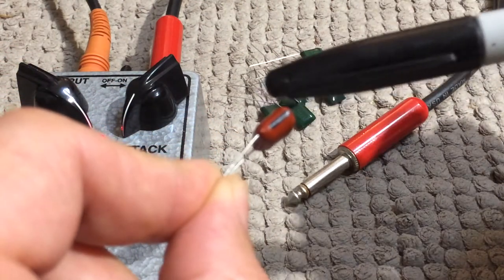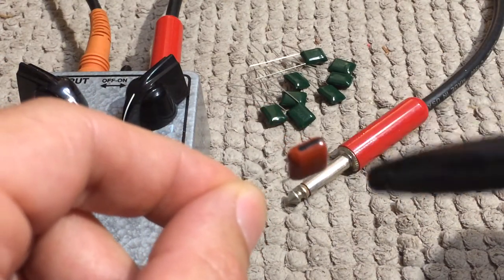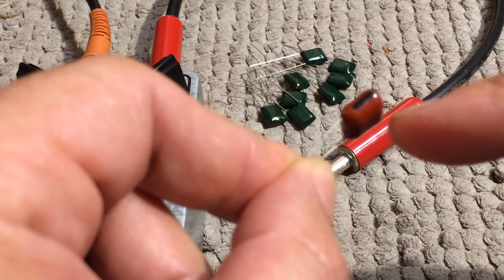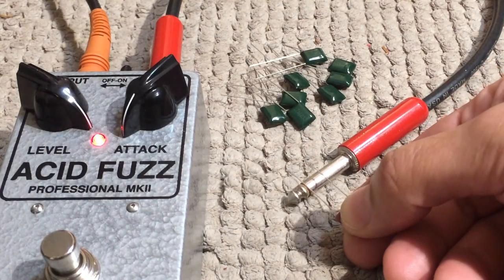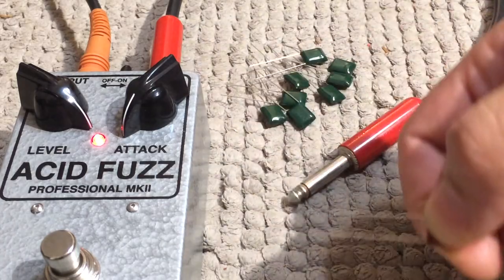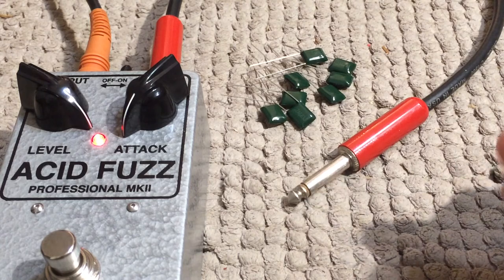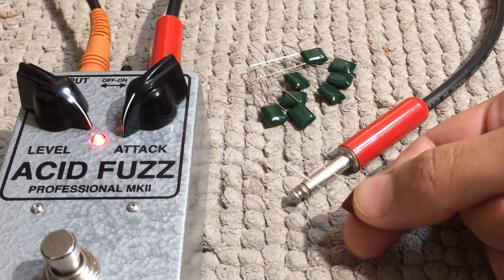I just take a Sharpie and mark the outside foil. If you think that's messy and don't want to see the marking, you can take some alcohol and it comes right off. The outside foil you've marked always wants to go toward the low-impedance side of the circuit — in this case that's the shield — and the high-impedance side is the tip going into the circuitry of the fuzz pedal and then into the tube amp. Most times in stomp boxes running at nine volts this doesn't make much difference, but if you have an inherently noisy, gainy circuit or one with an oscillator that could induce tick, this can definitely help keep noise down.